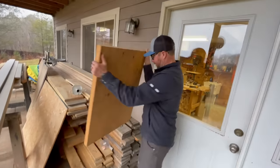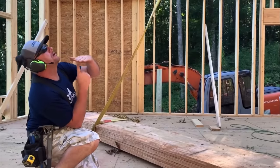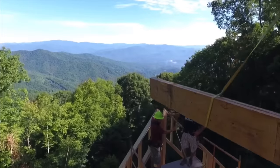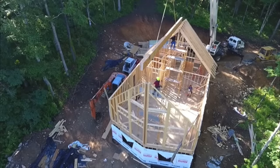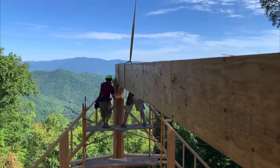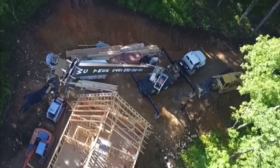Here's something we're getting rid of — a 24-inch deep LVL. This came off a ridge beam we put in a house: it was four-ply, meaning four of these sandwiched together, 40 feet long. We calculated it weighed around 4,000 pounds — a seven-by-24 by 40-foot beam. We had a giant crane lift it and we all survived. I think Rake can make a good little workbench table out of it.